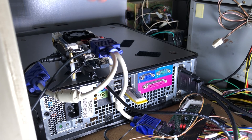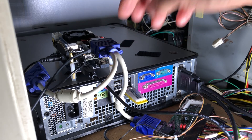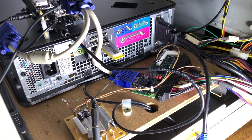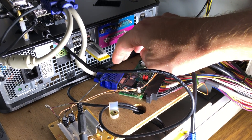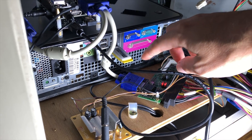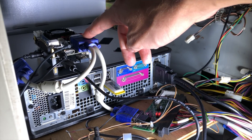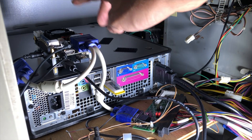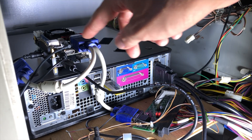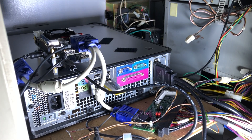It's a little bit messy, but what you can basically see here is I got my MiSTer wired up in a couple of ways. The VGA output goes to the JAMMA, which is basically what will allow you to put your MiSTer into an arcade without much trouble, because it has a USB input which you can plug into pretty much everything — it just emulates a USB keyboard. That's the input, and then you have the video signal input. So I connected the VGA cable to the JAMMA on the MiSTer side, and also USB, which is being used to map key presses from the emulated USB keyboard and outputs them on the JAMMA as button presses or joystick moves.